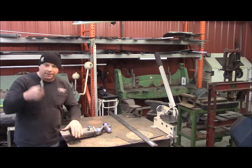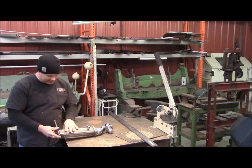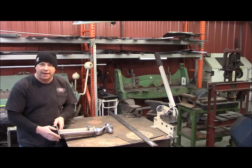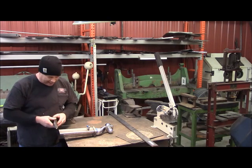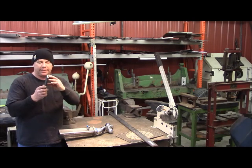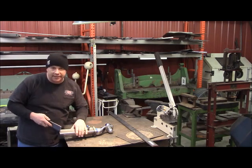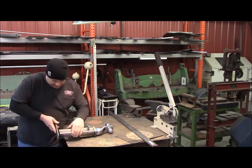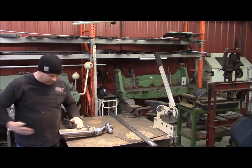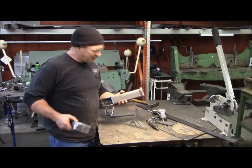In doing so, I could just put a flat plate in there and weld right at the end, and this will be located right in there. But that's going to look homemade, and I can make it a little bit stronger without doing a whole lot more work. I'm going to put this in my press brake and put a radius in it, then cut that radius into this hitch and put it in here so it'll be a radius end — that way if you run over something, it's just going to scoot off of it. I really enjoy doing this cut-and-shove-to-fit type work.